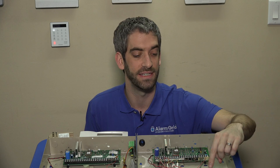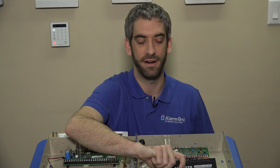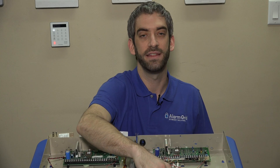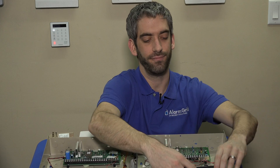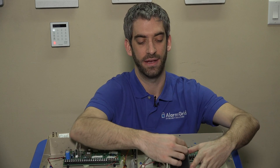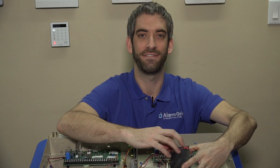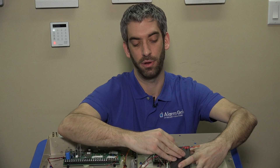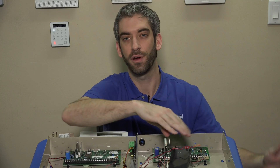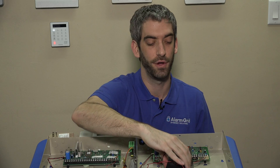You've got a sealed lead acid battery sitting right in the bottom of the cabinet. On top you'll find a black and a red spade connector — they simply slide off. If they're old you may have to wiggle side to side as you pull. You don't have to disconnect both; one lead off fully disconnects power to the system.